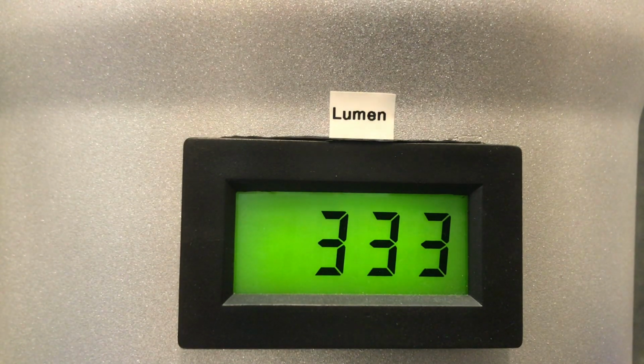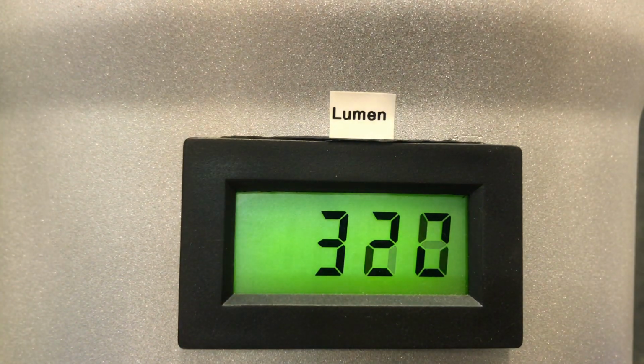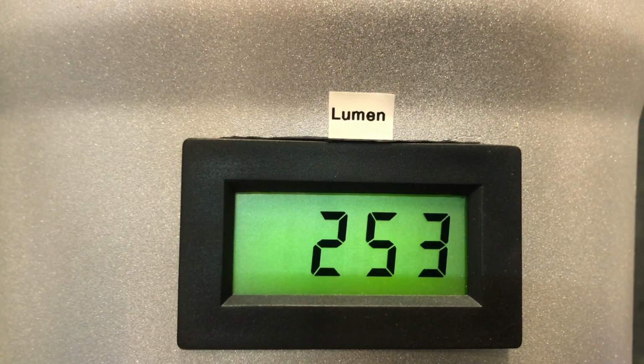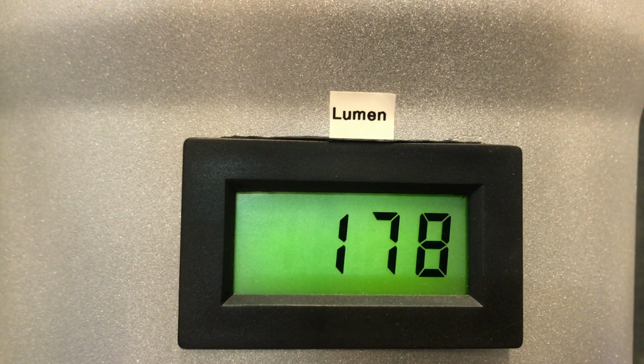So it also does not deliver 3500 lumens. After about 2 minutes we still got 3200 lumens left. So this battery performs much better than the Efest Purple. After 3 minutes the light starts dimming down. It's now quite hot, around 60 degrees, so we're going to see at which output it will stop dropping. After 5 minutes we nearly reach 50% of the initial output. Now the light stays constant in this brightness mode. So I'm going to recharge the battery and then we are going outside in the garden.